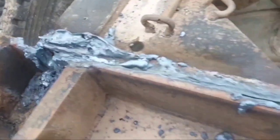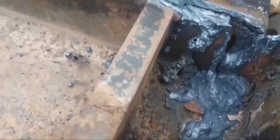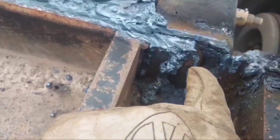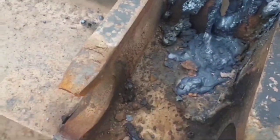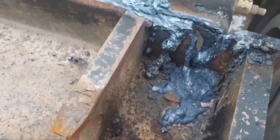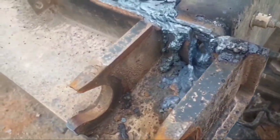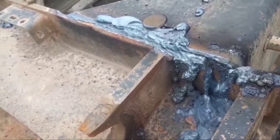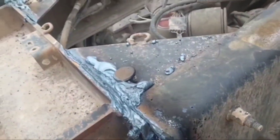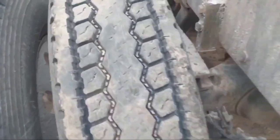Alright. I've got a good bit of that cut apart. I had to blow a little access hole here because I'm gonna have to just cut straight down through there with a straight tip and then finish getting the rest of this off, because I ain't got room to get up in there and cut it the way I need to with the wash tip without getting burnt up, and I've been burnt. It's not fun. So I'm gonna try to catch some more cutting for y'all.